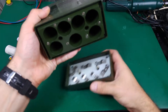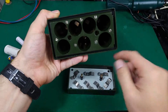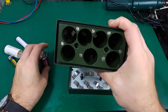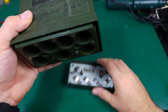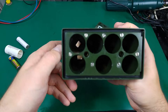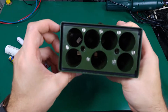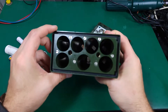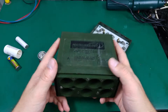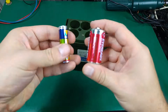This is how it looks from the inside. The batteries go in that direction, the positive going that way, just like on the picture, and it doesn't work. I was trying to spray a cleaning solution on the contacts because I was thinking maybe they are dirty, and I was reaching and cleaning them, but nothing — still no voltage on the output.